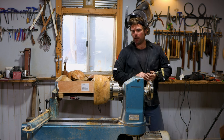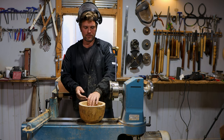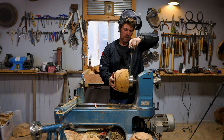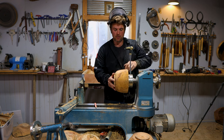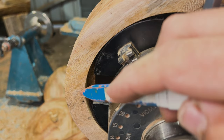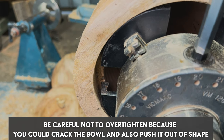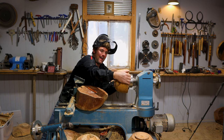Put your tools away — that's why I like my little trolley. Take the bowl off. Now when you turn it around you will expand to the inside of that shoulder you've just created. Hold the back of your bowl, expand your jaws. You can see why you might need a larger set of jaws if you're doing bigger bowls. Place it in until you can feel the outside of the jaws resting up into that shoulder we created with the gouge and skew chisel. Expand your jaws into it, tighten it up — have your hand on the other side pushing against it and holding it nice and tight.